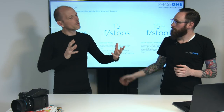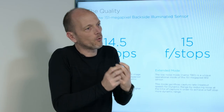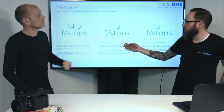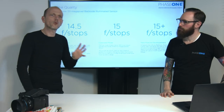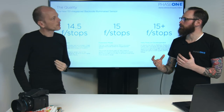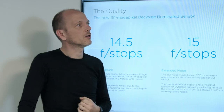In addition to this, we've used some of the ability to add more electronics to add some tricks to the sensor, where essentially it can read out the data much more carefully. Therefore, it can generate a digital signal with even less noise by spending more time in the analog-to-digital conversion. That comes down to the extended mode in terms of a single capture — we can get 15 stops of dynamic range from a single capture. It's still one exposure, but the sensor and platform spends more time converting this single exposure into a digital signal — much more carefully. The trade-off is that it shoots much, much slower — you sacrifice some frame rate for a more clean signal. This gives us back the same 15 stops as in the Trichromatic sensor.